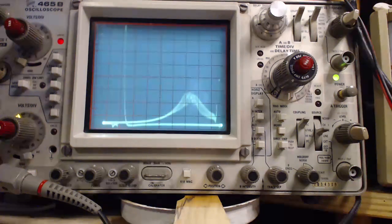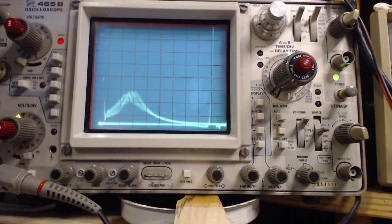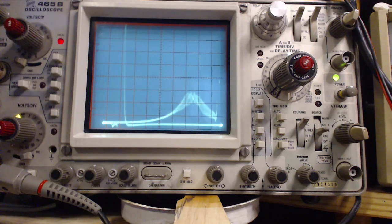There's this phase control, which generally flips things around there. I'm not so sure that's working the way it's supposed to. I've got to get a frequency counter onto the signal coming out of the marker — the little extra added marker amp. It's supposed to be an audio frequency. We can look at the signal — let's do that.